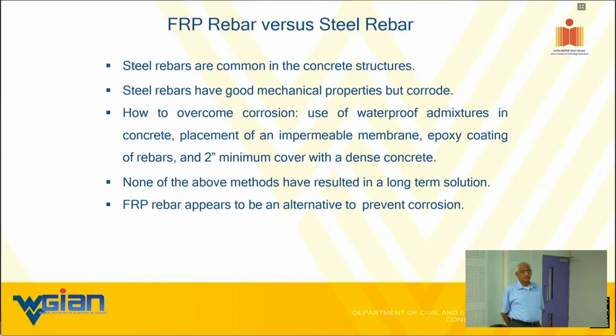For example, they don't want you to pour concrete in the morning as opposed to having it late afternoon, so that the evaporation of moisture is minimal while it is having initial curing. You understand? All the terms are important. Initial curing. So that way you would reduce the crack density. And then they want to have a very high density type concrete with low water cement ratios. When we talk of low water cement, that's where your problem is.